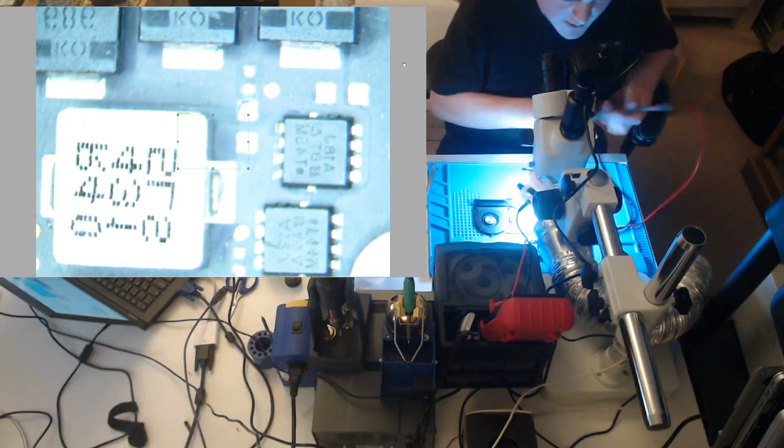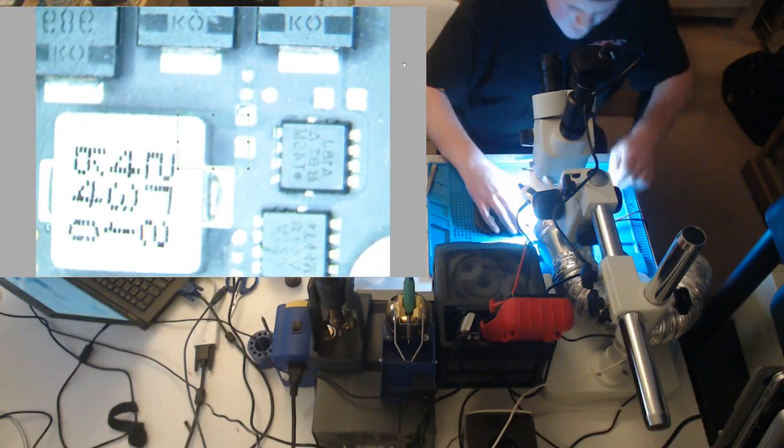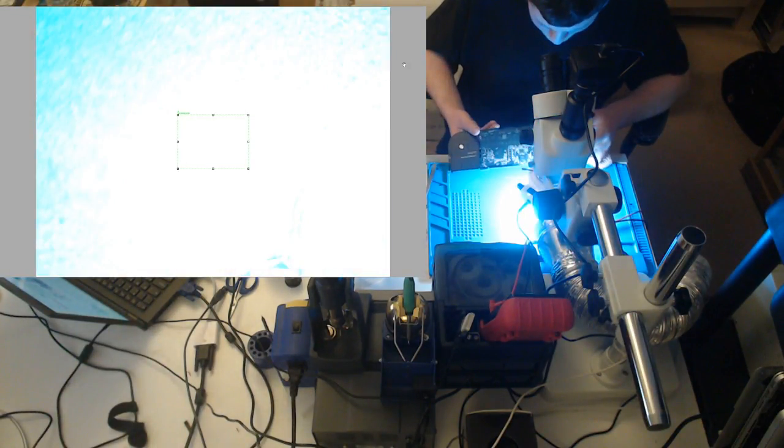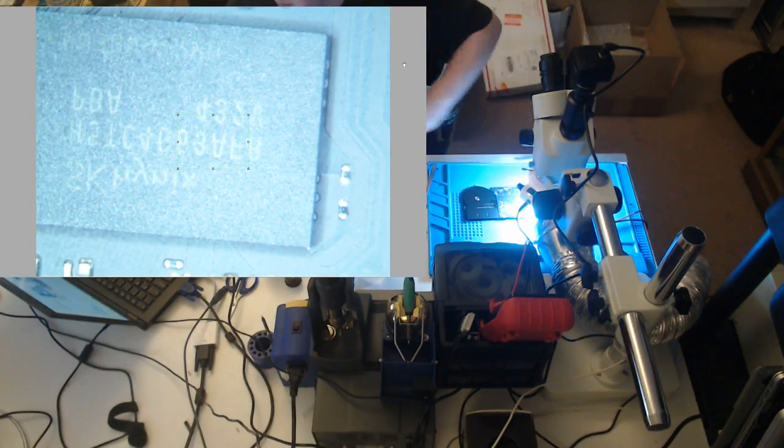So that leaves us, it is an issue in generation, I think. I don't know. I'm going to have to do more work on it, wipe it out, and this one was not going to be a fun one. So we either have, I really doubt it's a dead CPU now after my V-core. I think it's an issue with one of our FETs that I'm just going to have to wipe out and rebuild that entire circuit. I don't think it's a CPU. It's still a possibility. I really, really highly doubt it now, but this was not a fun one, and I'm going to change the title.